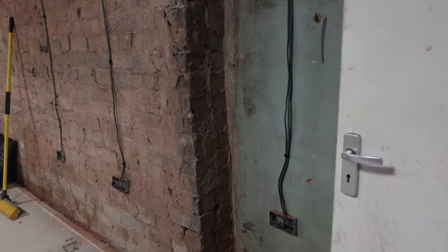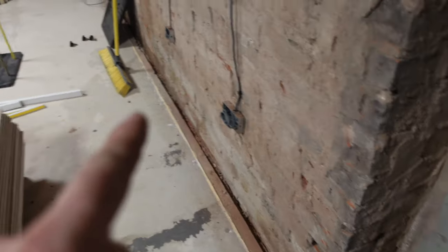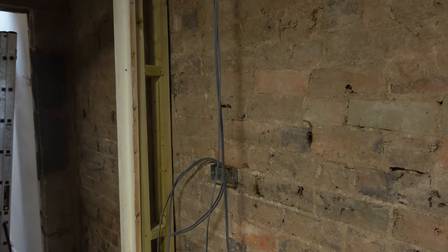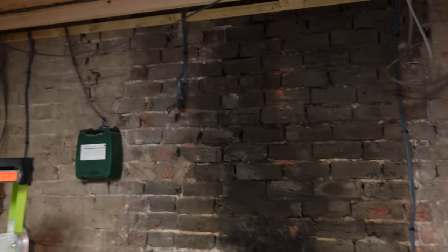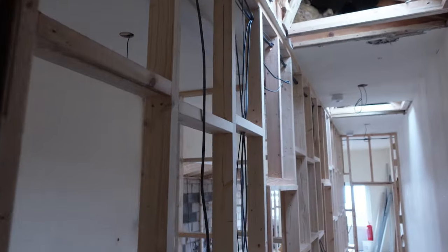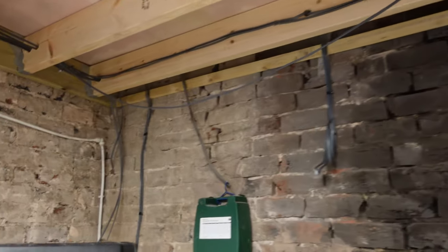Here's where we're up to. To get the cables down to the sockets and switches, I've put a bit of all-band on the wall, wrapped it around — it's all getting dabbed over with insulated board so there's plenty of room behind. We've got socket, socket, spur for a heater, light switch — I haven't finished that because I've run out of three-core. There's also an extractor fan cable left to coil, and a socket down here. This is the existing cable that comes down through that wall, feeding a little fuse board in here that did this side of the old shop. We'll be getting rid of that.